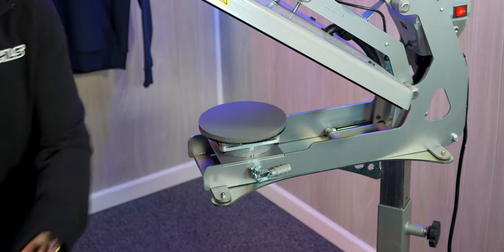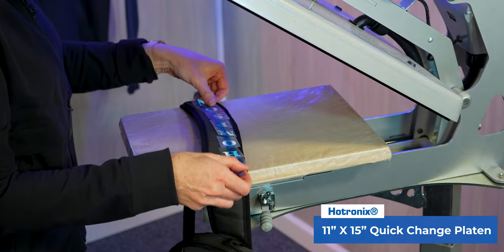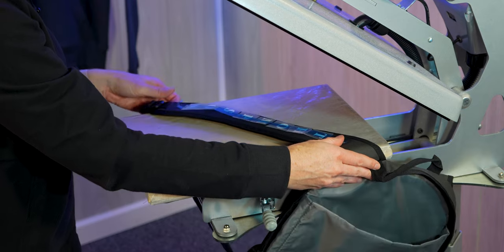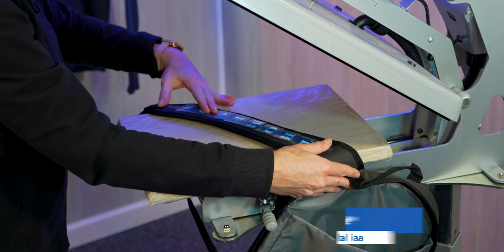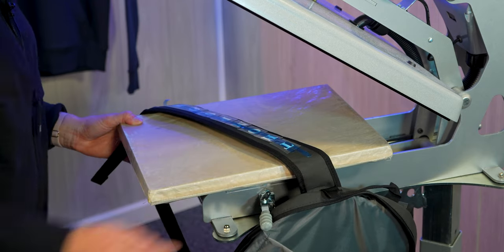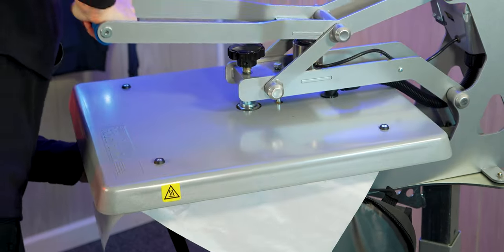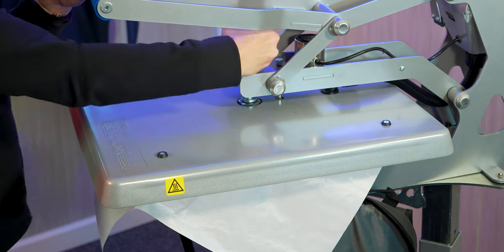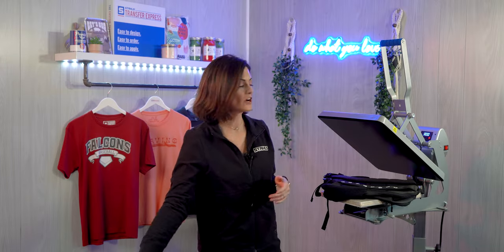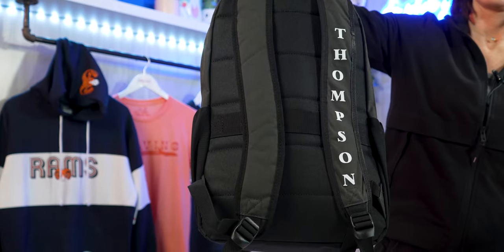First, I'm going to change the platen. We're going to switch it out to the 11 by 15. Now, I've already gone and aligned my last name how I want it. I know it's going to flow with this back strap, and I'm just going to use thermotape to tape it into place so our name isn't going to be in the wrong location. Cover sheet. And I've got that plastic buckle out of the way so we won't have any chance of it melting to the upper heating element. Once you are done peeling your carrier and you've removed it off of your platen, now you can see that we have a personalized strap on the back for a unique location, and we've also personalized it with the player number.